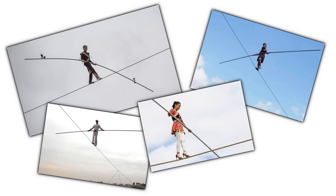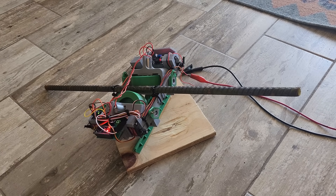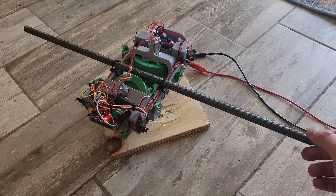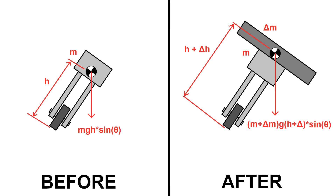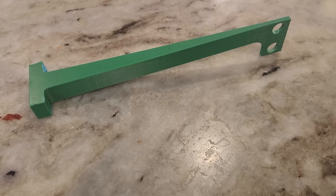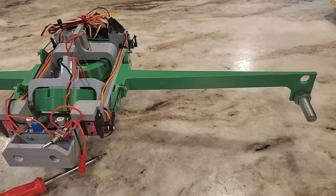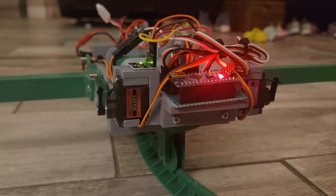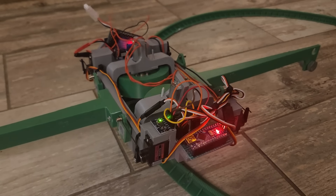This is the same reason people walking tightropes carry those really wide stick things. In a best case, I could maintain stability for a couple seconds with that change, but it still seemed like the gyros weren't able to save it once it tilted 5 or 10 degrees. One problem with the big piece of rebar is how much weight it adds above the top of the vehicle, increasing the destabilizing torque from gravity. To fix this, I printed lightweight booms that would carry some half-inch bolts out away from the vehicle — two of these would provide approximately the same moment of inertia contribution as the rebar but with way less weight. After that change and a couple hours of fiddling with the gains and tweaking my code, I finally got something that seemed stable.